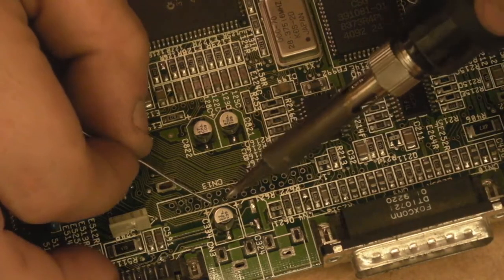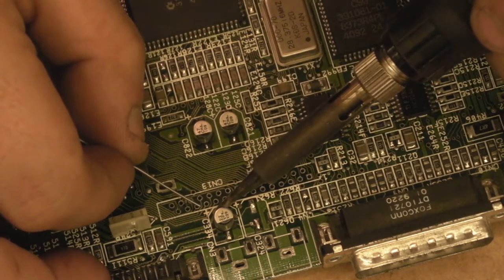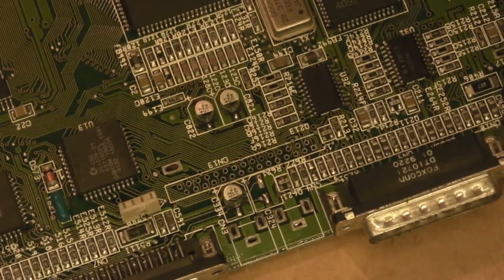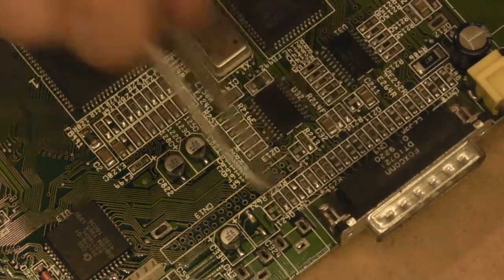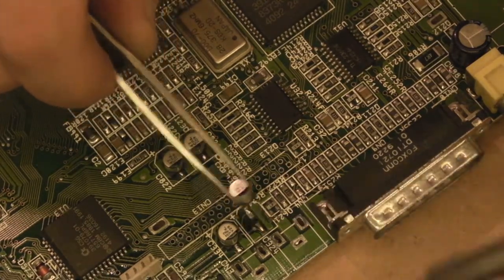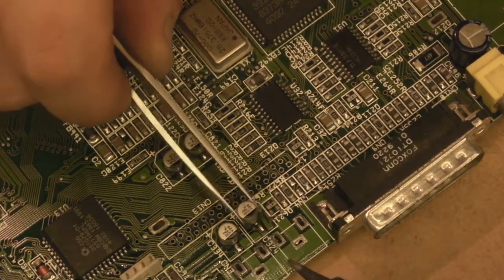But it's the fact that he adds that little bit. He adds that little bit of solder first. That's fit really nicely. That's quite a nice technique actually. I think I've got quite a nice join there. I'm going to try that again. I mean, all I've done in the past is I've had both pads clean. I've had a little dob of solder on the end of my iron, put it in place, and then just use that dob, with capillary action, to wick it in place. But no, this technique does work.